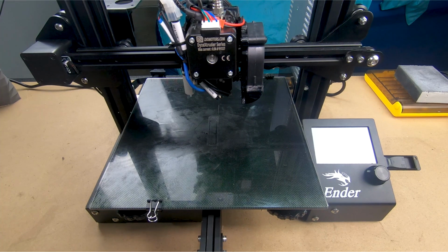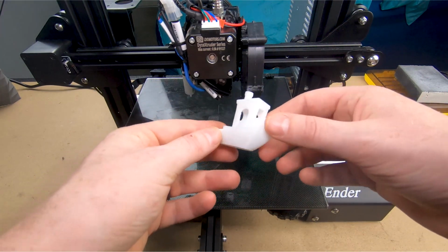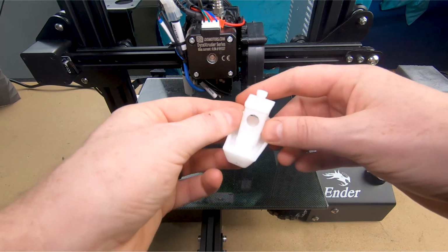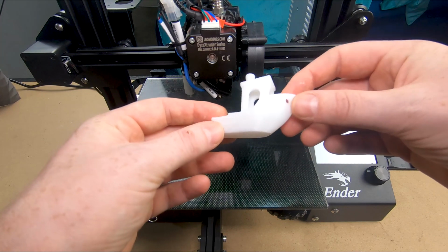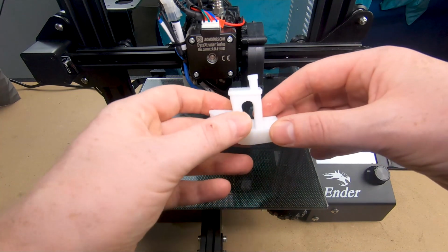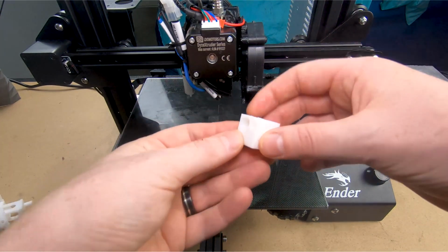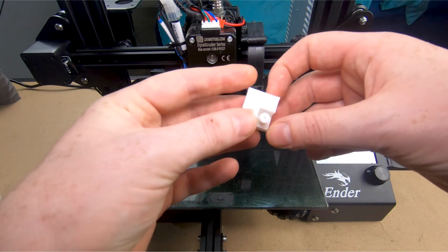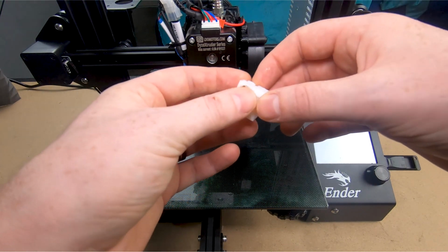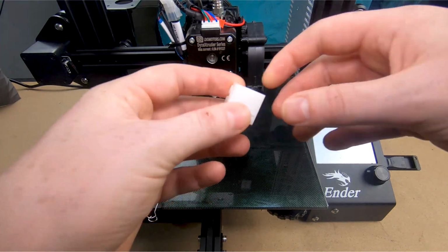Now we've done a few tests with this, and we started off with a PLA Benchy. This was just standard settings pretty much. We've calibrated the E steps on it, and that's basically all we've done. I think it's done at 40mm a second, and it's come out really clean, which is surprising considering this is a full metal hot end. So then we did a quick little calibration cube as well. Once again, came out great. We'd still probably dial this in a little bit. I think it's about 20.3mm, so 0.3 tolerance is normally what I work to anyway. So I'm pretty happy with that.